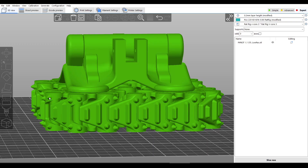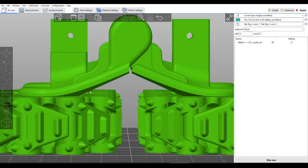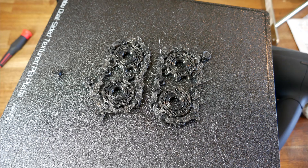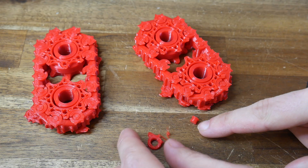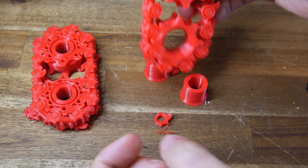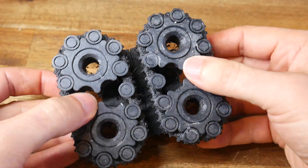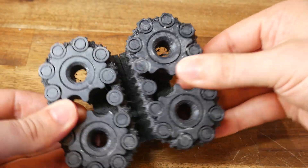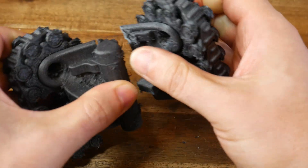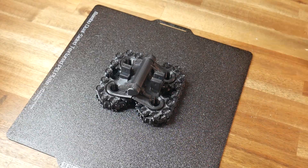All of these pieces around the outside are parts of moving tank tracks, and they have quite steep overhangs. And then in this central hollow section, we have even more steep overhangs to truly test our machine. I started trying to print this in PLA, but those little overhangs kept on curling up, catching the nozzle, and then dislodging. I tried PLA with a few different machines, but the result was always the same — one small segment would come loose and knock the others around it loose as well. I tried using some ASA, as it won't ooze as much as PLA, but I'm pretty sure I had the wrong print settings, as it ended up a melted mess. PETG was the happy filament in the Goldilocks zone, and this printed first go on the P1P, only slowing down the speed very slightly to help with the part cooling.